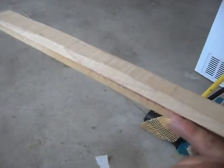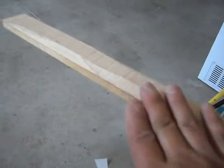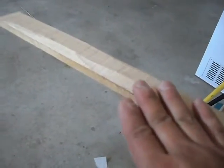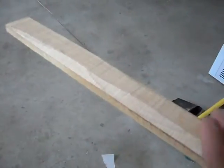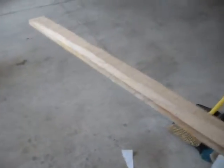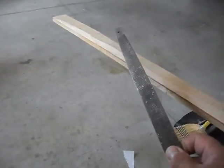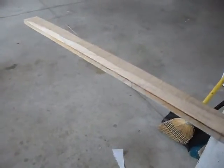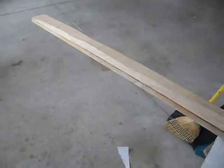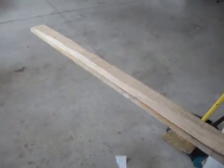What I try to do when I do this — as noted in my previous video — I'll rasp the limb down to the line on both sides, and then I'll rasp down the center of the limb to make it flat. We'll be using a rasp today to get that done. When I get close to that flatter surface, I'll turn the video back on and show you what we've got done so far.